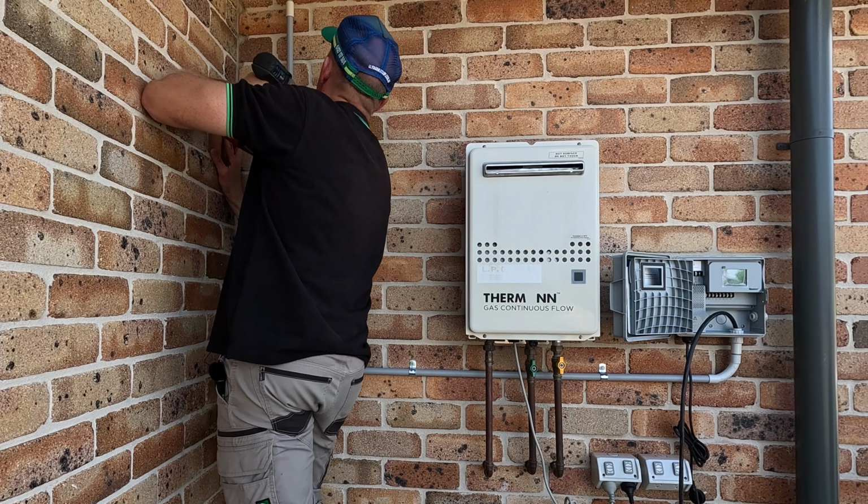So the cable's all pared back now. I've separated out all the different pairs, if you will. Now, this actually technically isn't irrigation controller wire, but it does work perfectly fine. In fact, irrigation controller wire is normally gonna have different colors so you can line them up and match them up to your valves out the front. This stuff is just as good because it's actually numbered.